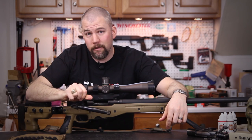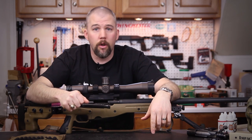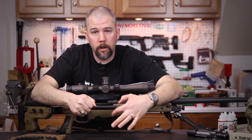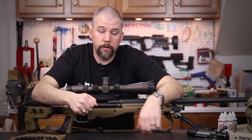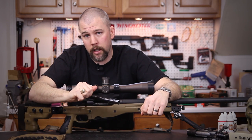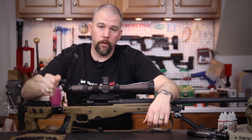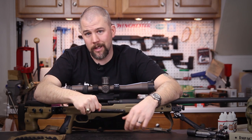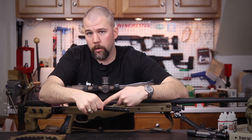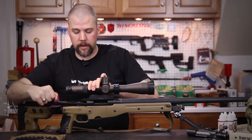The AE also has some really interesting features that allow it to work better in a nasty environment. The bolt is fluted, but it's not fluted like the pretty bolts you see on custom rifles. We're used to seeing helical flutes on Remington 700 custom bolts, but on the AE Mark II the actual part of the bolt you see through the ejection port is smooth. Where it's fluted is back here where it rides in the action, and what that does is give dirt, grit, and mud a place to build up so that you still get smooth bolt manipulation. It's not in a place where blowing wind will cause the grit to collect in the flutes and then pull the dirt into the action when you pull the bolt back. When the action is closed the flutes are protected, but when you start moving the bolt, the flutes just give dirt a place to go.